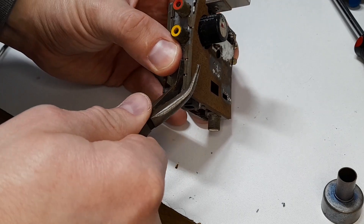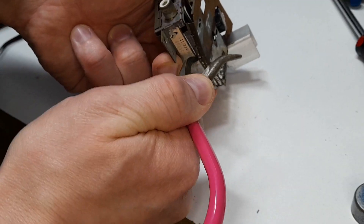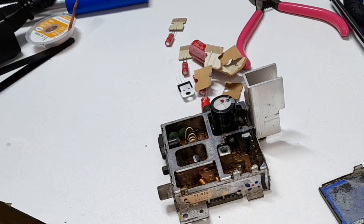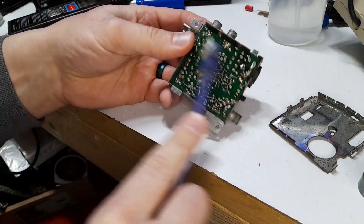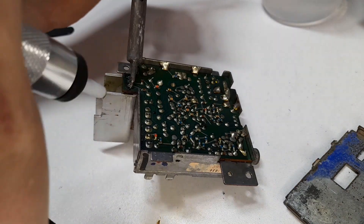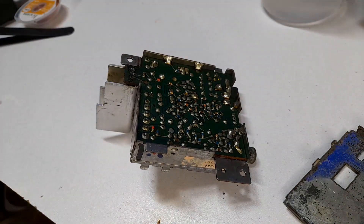With this off the board, I'm able to pop open the top lid and easily access all the capacitors underneath. I have one of my capacitor kits to replace all the capacitors and the voltage regulator. I started by cleaning any dirt and grime on the bottom of the board with isopropyl alcohol, and then I started taking off the solder around the capacitors and the voltage regulator.